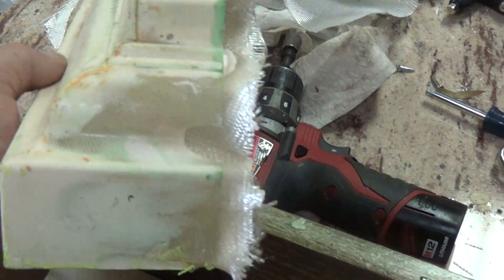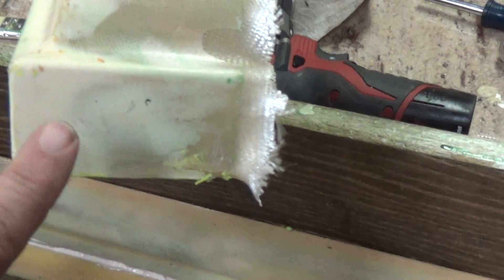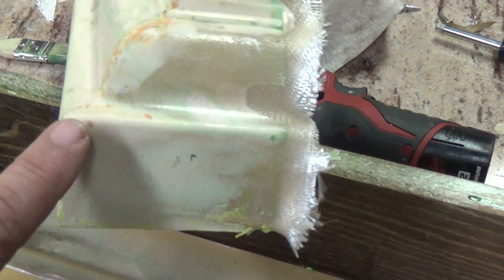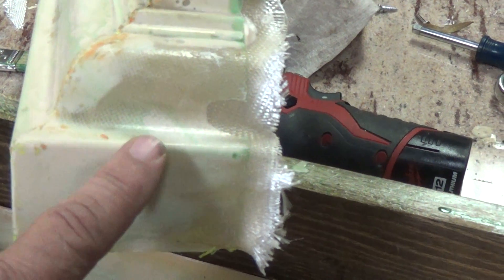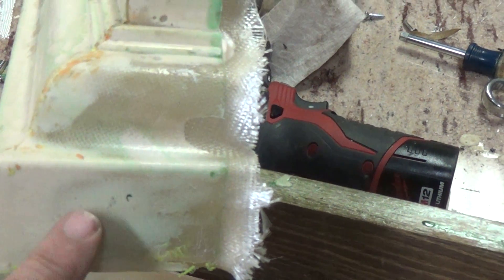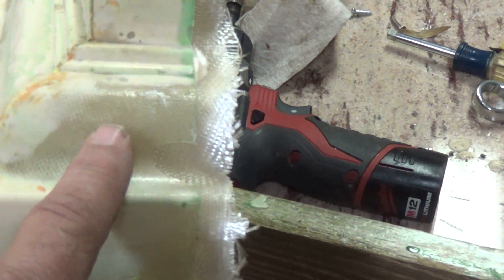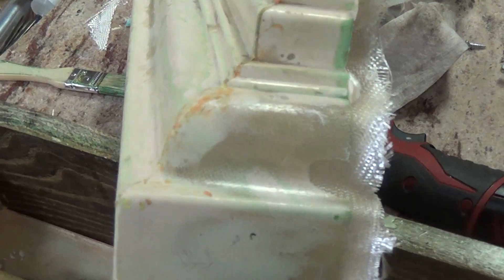I'll try to point them out here. These light parts here are actually what you call micro — it's a peanut butter mixture that you put in the corners first and in the fillets. Here is just plain glass, but in the mold I'll show you right here.